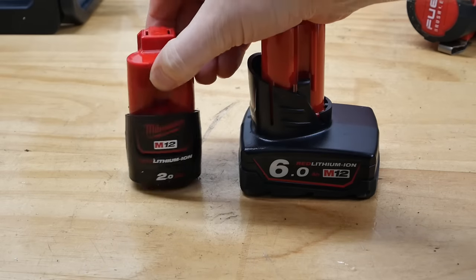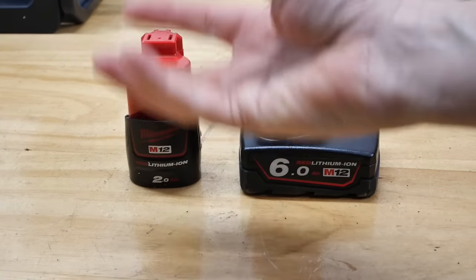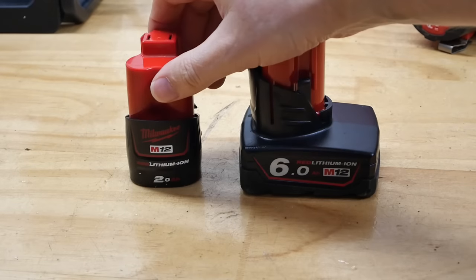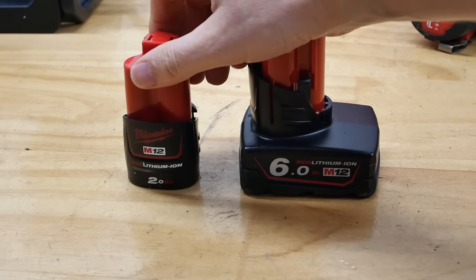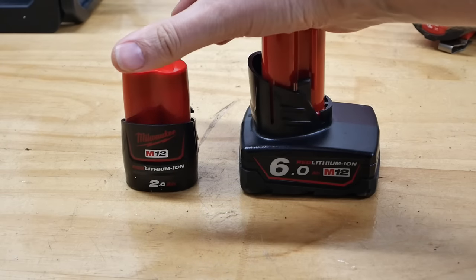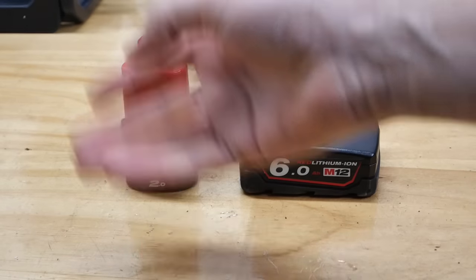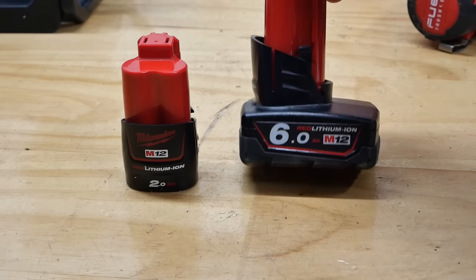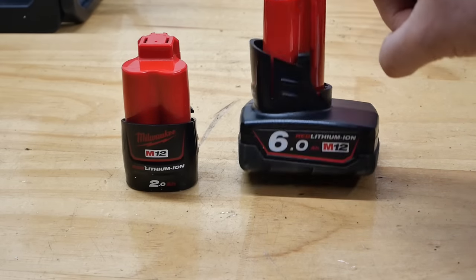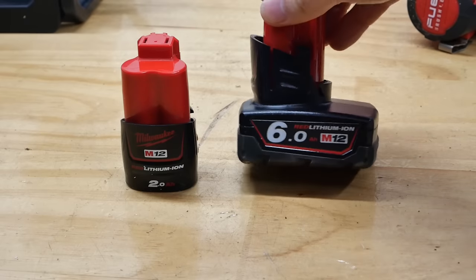So in that test when you were seeing me use the 2 amp hour battery, you would have seen it lose pressure. I would pick it up, turn it off, turn it back on, and away it would go at full pressure again. At first I thought that was because it's clogging up and silting up at the bottom and losing pressure — turn it off, all the water runs back down the tube, smashes all the debris out of the filter at the bottom, turn it back on, away you go. But then I held it up suspended in the middle of the water, clear of all the debris on the bottom, and it still did the same thing. Ran fine for 2 or 3 minutes and then lost pressure. So with the 2 amp hour battery it was the same cycle — 2 to 3 minutes and it would drop down. Now with the 6 amp hour battery it's been going for at least 8 minutes and it doesn't seem to be losing pressure. So it was something to do with that 2 amp hour battery — it might not be able to sustain the current draw that the tool requires.